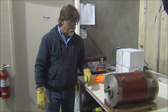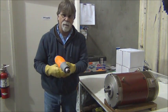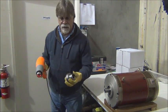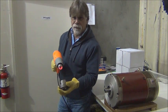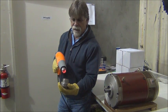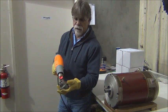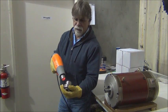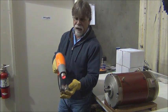As I mentioned, we're going to use a heat gun to heat this coupler up. Wearing gloves to protect our hands from the heat. I don't have to heat up the entire coupler because only the portion from the shoulder out slips on the shaft, but I'm going to concentrate the heat on this one half of the coupler.